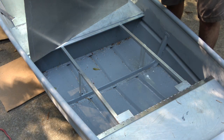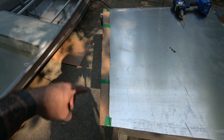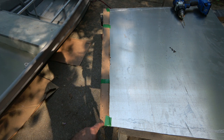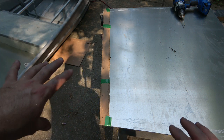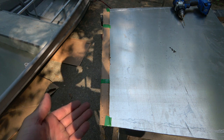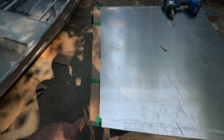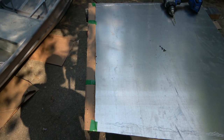Now I need to figure out where to drill the holes to get them lined up for the piano hinge. What I ended up doing was cutting a piece of cardboard the same width as the front of this. I slid it on top of the piano hinge, folded it up, held it in place, and marked all the little holes. I think I've got it right, so I taped it to the front of this. I'm going to drill out these holes — not all of them, but I went ahead and marked all of them. Fingers crossed I'm not screwing this up.